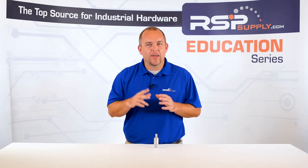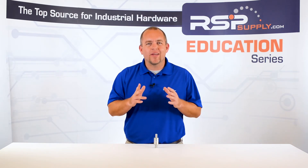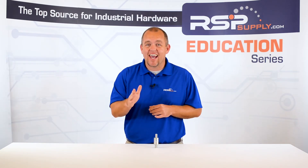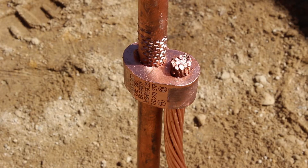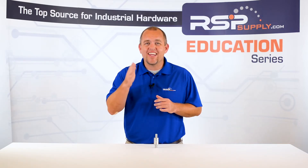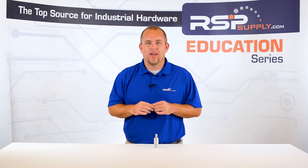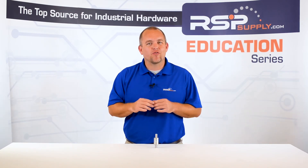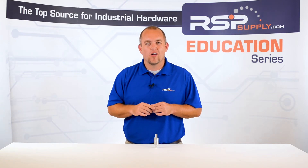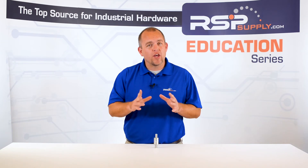So how do we accomplish these two things? First, when installing any radio equipment, it is a good idea to have a dedicated ground rod for that system. In the event of a lightning strike, this ground rod will give the energy somewhere to go that is very quick and easy without having to enter your control system. This is very cheap insurance for your radio and other electrical hardware, so make sure to use a ground rod when installing a radio antenna.